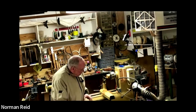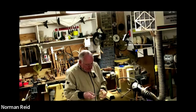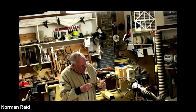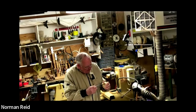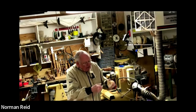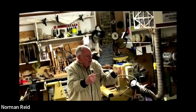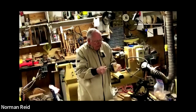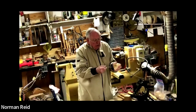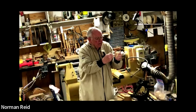So that it's perfectly circular. If I take the calipers and I put the calipers in the flange like this, and I've got it at the bottom of the flange now, and I pull the calipers out, that's a constant pressure on my part to pull it out. And the legs really don't move at all when I go in and out. And that tells me that this is perfectly circular.